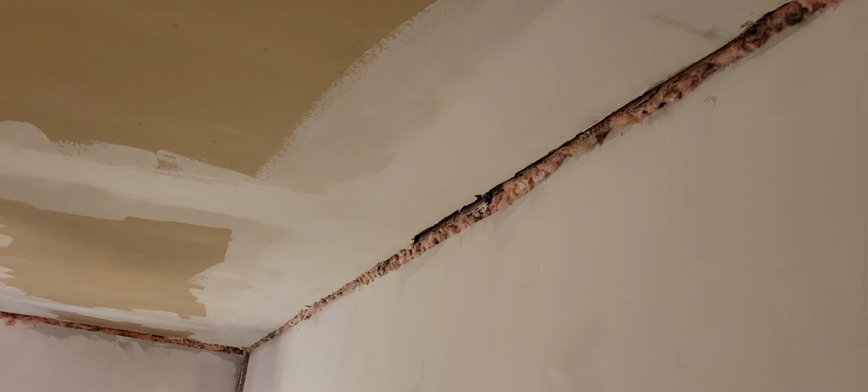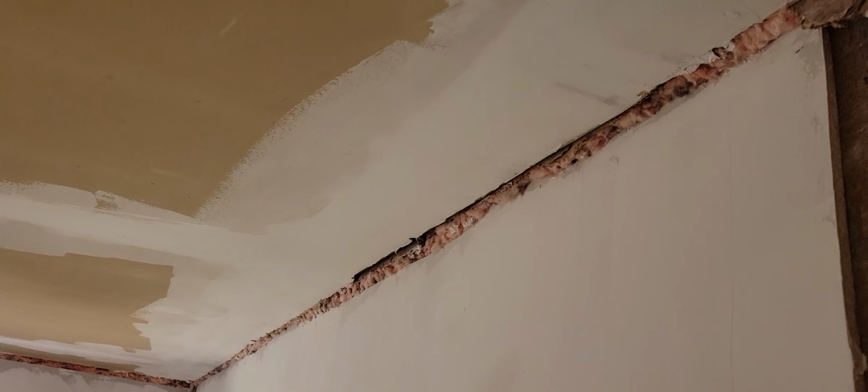So we start with the south facing, or southern, wall. Big expanse of sheetrock. And if we go down here, I think it turned out super. At the bottom there's the floor. There is plaster stuck on the floor, which will be easy to clean off. Up on the edges, the wall and the ceiling did not form a tight joint for various reasons. I'm going to put crown molding there so you won't see it. It has the foamed-in insulation in it, but we stuck this pink stuff in to fill that space and at least slow the mice down when they appear.